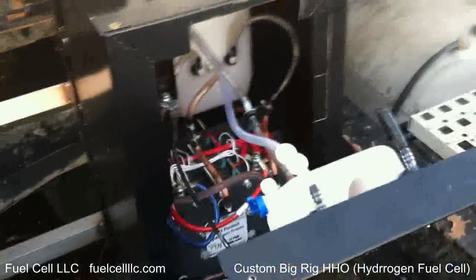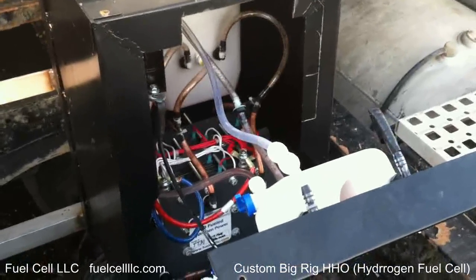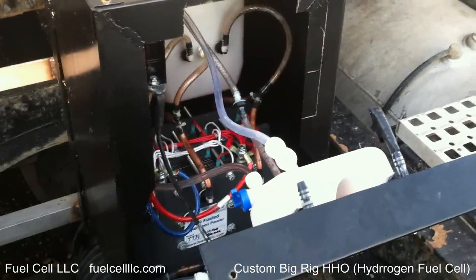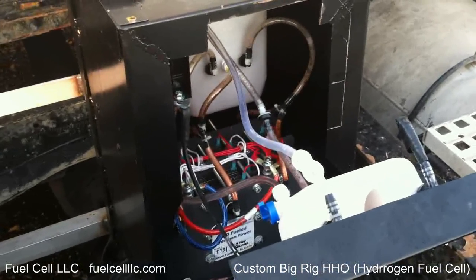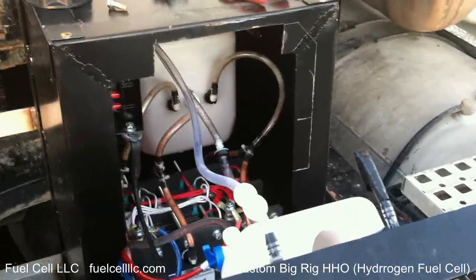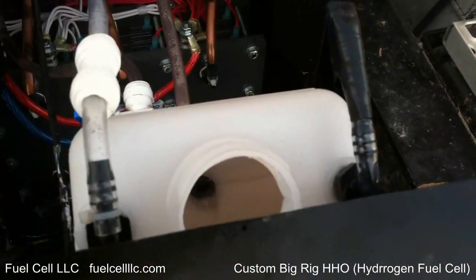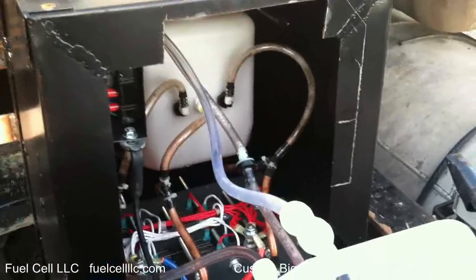When you're sitting at 125 degrees and you're eight hours into it, you know you're doing pretty good. Now if it went to 200 amps, I'm sure it'd get up to about 135 degrees and feel a little bit of heat, but not enough to make steam. Overall, this cell is going pretty good — nice and steady. Hasn't missed a beat the last three weeks of operation.